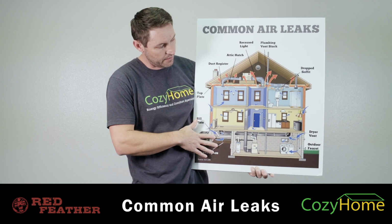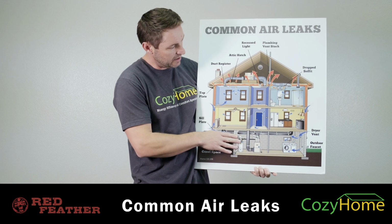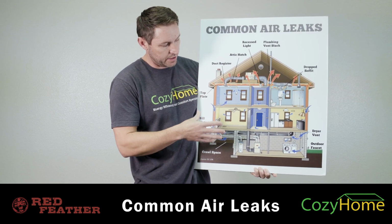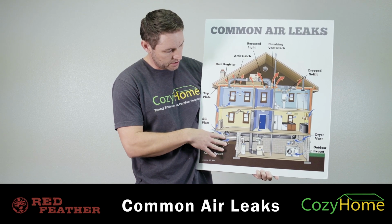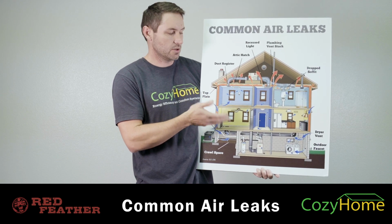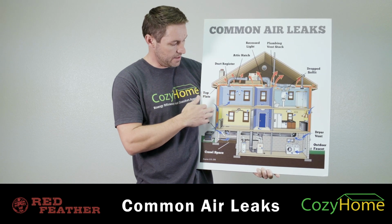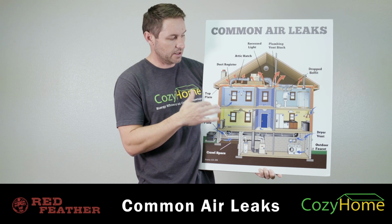So this is a little diagram of a house. A lot of people don't have basements, so you can just ignore that, but it's all the same in terms of places where air can leak in your home. On this diagram, there are blue arrows and red arrows. The red arrows are spots where air will leak out of your home. That's called exfiltration, where air is leaking out of your home. And the blue arrows are where cold air will come in, and that's called infiltration.